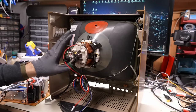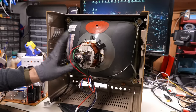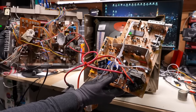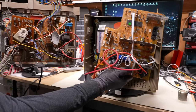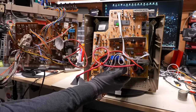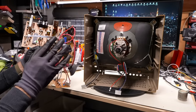I wanted to point that out as a way to easily refresh one of these monitors — I've actually done that before with this very CRT. I swapped the yoke over, tested it with the original electronics, and it drove it perfectly after a little adjustment of the drive and bias levels. These 1702 boards are extremely reliable; generally if there's a problem, it's probably due to a crack from the monitor being dropped. As a refresher, the biggest difference with the newer board is that it's multi-standard: PAL, NTSC, and SECAM, while the original only supports NTSC. Having a multi-standard CRT is completely uncommon in North America, and for someone like me who has retro computers from overseas, having a monitor that works with those systems is completely worth it.